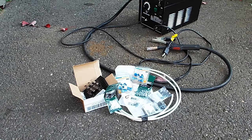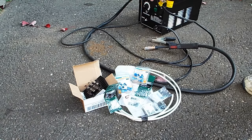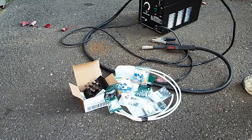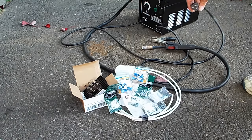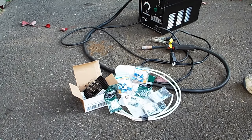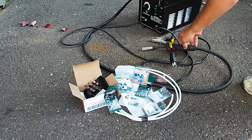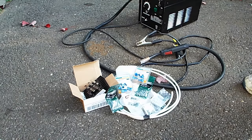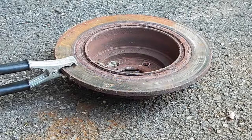The whole reason I'm converting this over is, first of all, the weld quality of the AC — I'll do some AC welding in a few minutes here for a before-and-after. Also, the convenience of having a 110 plug means I can take this virtually anywhere and plug it in; even a thick rugged extension cord will handle the amperage. So it makes it more versatile, and having it weld in DC — with the electrode negative and the clamp positive — should weld much better, as videos online have shown. That's known as DC EN: direct current electrode negative.